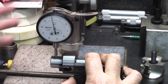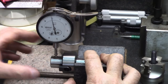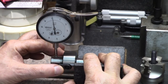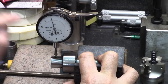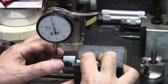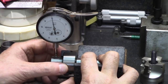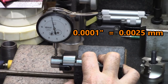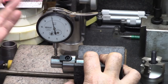The first test: I installed a stop in the rear to keep my block, which is a Mitutoyo lab grade, so we don't have to worry about that block. One tenth of a thousandth. We're installing a shaft in there. I'm going to try to keep the pressure as constant as possible on my fingers and rotate. We're solid there. See how this deviates from zero. Every time I stop — about every 45 degrees — we're deviating plus or minus one ten-thousandth of an inch, which makes the axial concentricity pretty interesting on that part. I would say this part is very acceptable. It's ground, it's hard, and seems to be doing a great job.